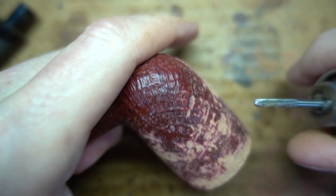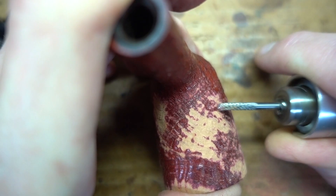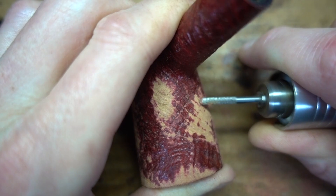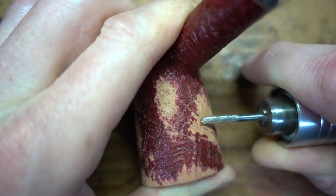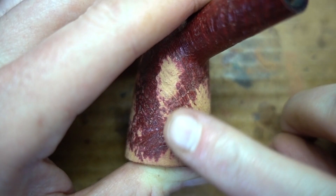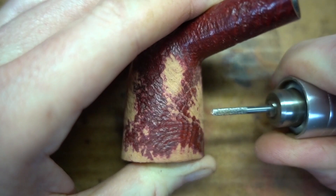So even though there's only a tiny little patch of wood here — here's one I haven't gotten to yet — don't let it live, so to speak. Do something to break it up. Now I'm pushing pretty hard here, and the slow speed guarantees that I have control even though I'm using a lot of pressure. And if you happen to see a fan of grain lines, like growth rings or whatever it represents, go ahead and replicate what you see on the adjacent wood as much as reasonable.